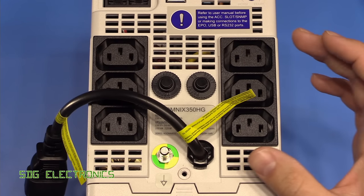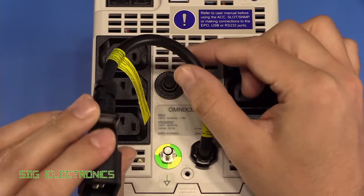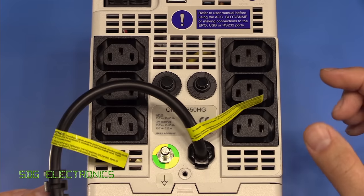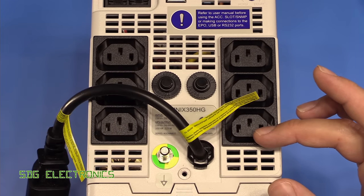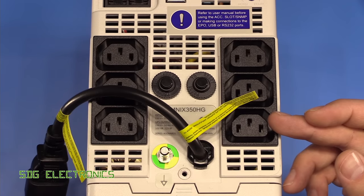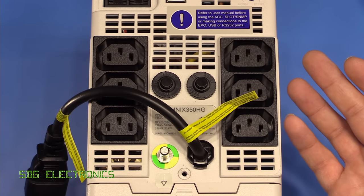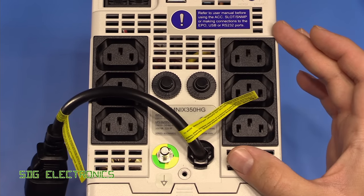According to the instructions, these are special medical connectors. We've got our AC input on an IEC flying lead, so it can be strapped into place to prevent it accidentally getting unplugged, and then these go out to your various pieces of equipment. Supposedly these are made from special plastic that reduces leakage current to less than 100 microamps. I don't fully understand that clause, because you wouldn't typically hook up a patient to the mains supply — it would always be through other equipment providing isolation.